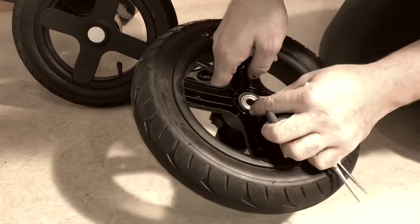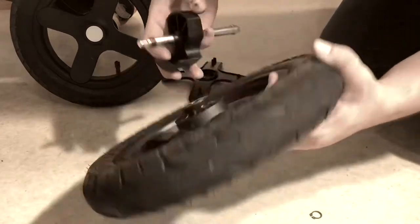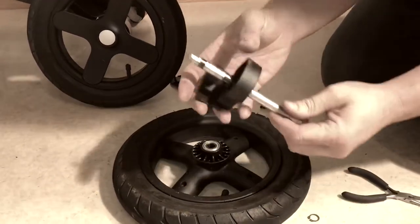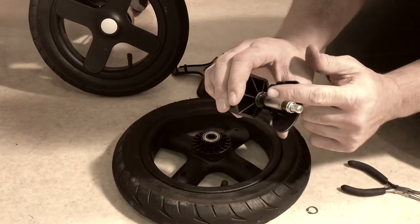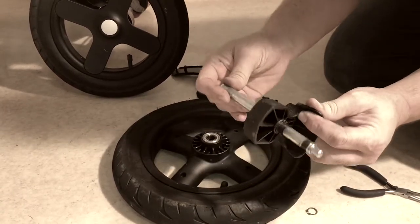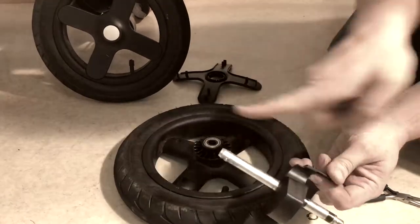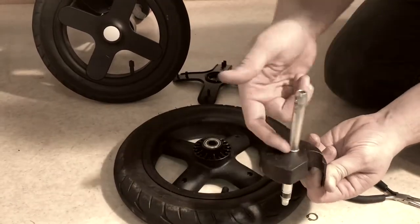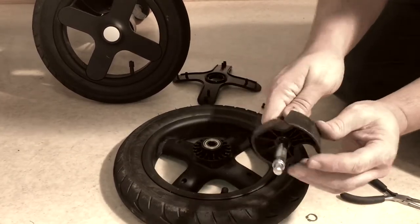When you pull it at the right point, you can press that axle through as you saw me do. Now you can pull out this entire assembly here — you have the axle and you have this piece on top. There is a second locking washer here. If you need to replace the axle, you would just open that up and slide this through. You have to slide it this way because there is a little bit of a lip here, and then you could replace the axle itself while retaining this plastic piece.